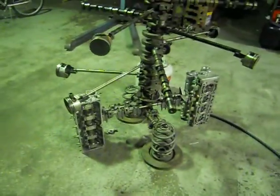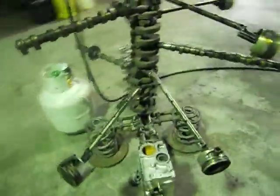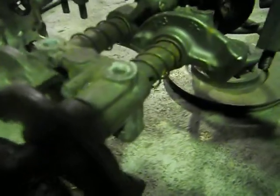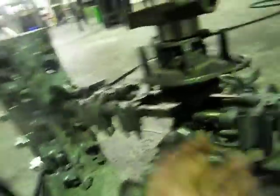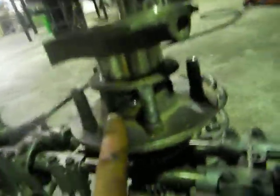What I've done is just used stuff that's been unserviceable. For a base I started off with a couple of disc rotors and a couple of rear suspension springs — coil springs. There's a rack gear off a Magnette there, and then I got an input shaft of a gearbox under here. I've actually put a wheel hub on there and then welded it to a crankshaft — that's a Holden 202 crankshaft.